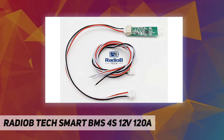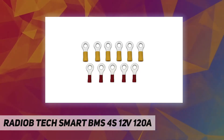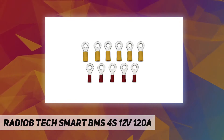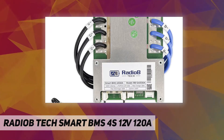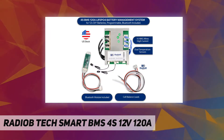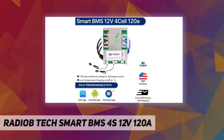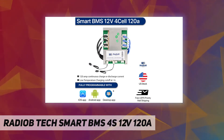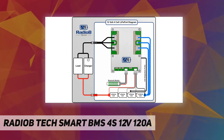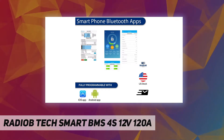Battery dimensions are 138 × 102 × 17mm, 120A version. This BMS is designed with a high-quality IC chip specially for lithium battery protection, with high detection precision on overcharge, over-discharge, voltage balancing, over-discharge and over-current detections, with configurable delay times. It also includes protection against over-voltage during charging, low-temperature charging protection, and precise SOC calculation with automatic learning.